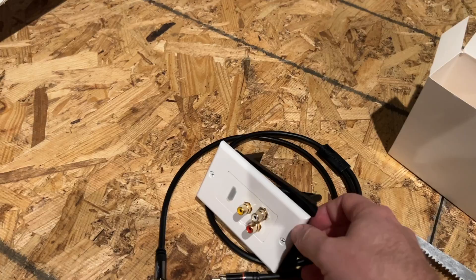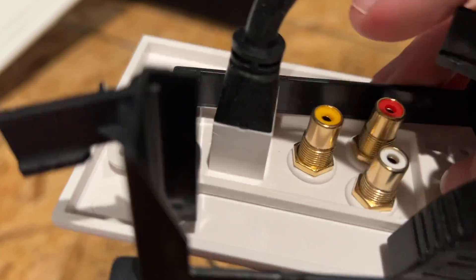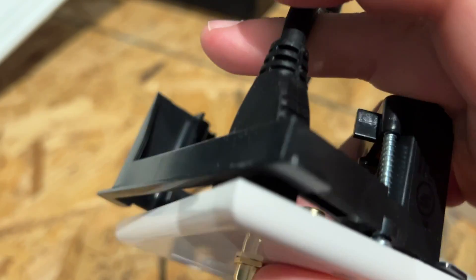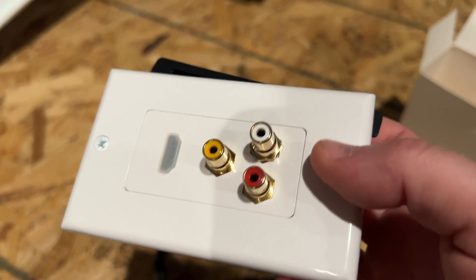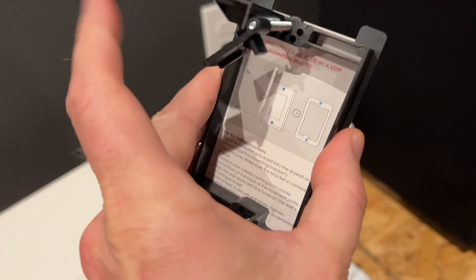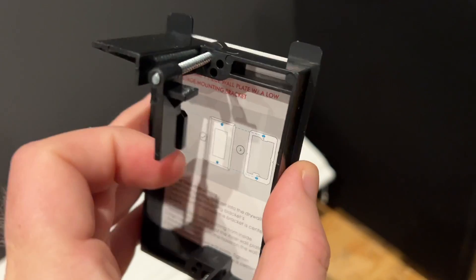I'm going to go through the speaker setup on my receiver again, now that I have those components in there with the correct gain on the subwoofers, and see if I even need that third one. All right, it's the next day. This little kit came so that I can install this into the wall — it gives you an option to run an HDMI cable as well from outside directly to my receiver. So I'm going to find a place on the wall that is between my studs. This is the plate that you put in there, you tighten it down so these tabs hold.